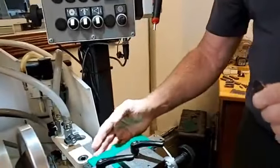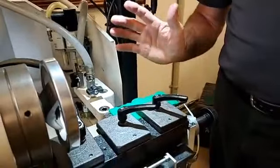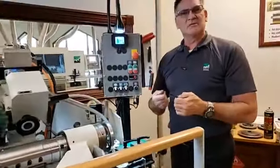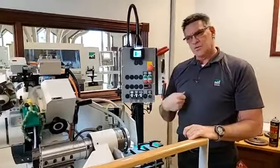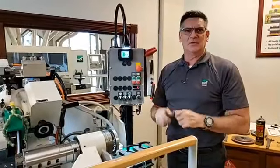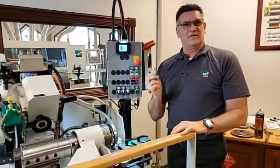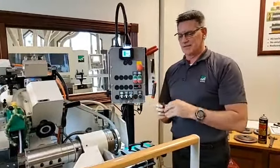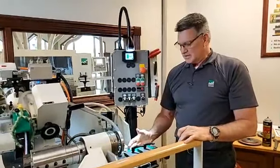So what we have found is that the plastic templates, yes, they've been around for quite a while, but we always used to make our templates by hand. And again, back to our earlier question, out of metal. So we'd do a lot of filing and stuff, and then we'd have to heat up the template and then dip it in oil and then buff the edge and all that stuff. Well, it made a very slick surface, and that was awesome because we can glide across it a little easier. But it was a very lengthy and sometimes costly process.